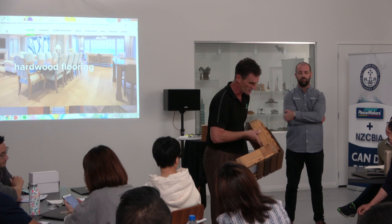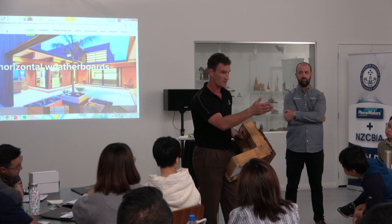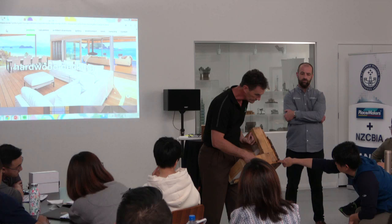So the point of ingress is the key to it all. So where the moisture can get in. And in this situation, it's right here. In this situation, it's about 60mm from the corner. So you need a bigger flashing. All of our details that you see in front of you show the moulding and the applicable flashing in behind. So you've got the right flashing, so you can look at that with confidence and say, okay, I'm going to be okay with that. Is there any flashing, no flashing there? Yep, there's a flashing sitting behind there. Oh, yeah.